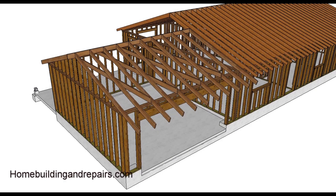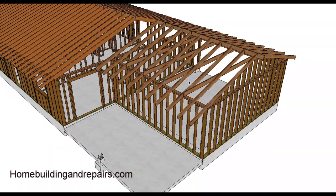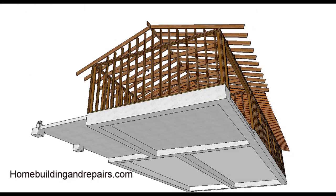Here are a few things you should know before enclosing a carport. Someone has a carport and wants to turn it into a garage or living space. A garage would look something like an enclosed carport with conventional framing, roof rafters, a ridge. You're probably going to have beams to work with rather than walls. The main thing I want to show is that exterior walls usually require some type of a footing underneath them.